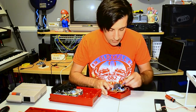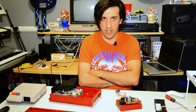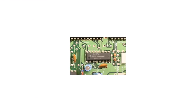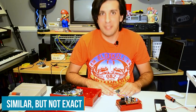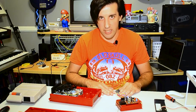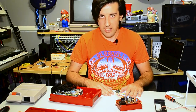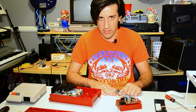On version 5 we have this little 4-bit chip, and from my research it is really similar — if not possibly identical — to the CIC chip found in the NES. The CIC chip is the lockout chip used to prevent people from playing unauthorized or pirated video games. It was also the chip that caused many people to have blinking screens and just generally caused a ton of headaches. A lot of people would disable this chip on their NES by introducing a voltage spike, but I don't really like doing that, so we're going to disable it a different way.